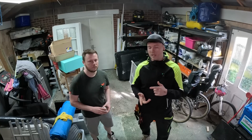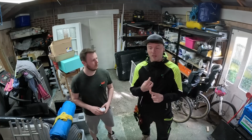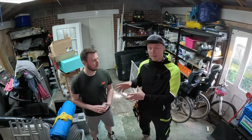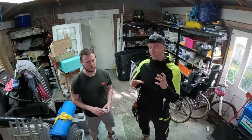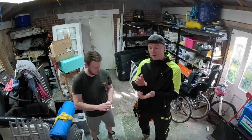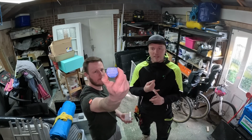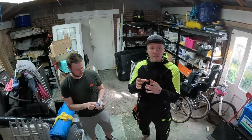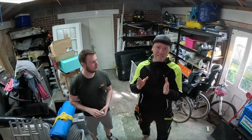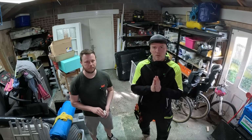You've already been up over the weekend, found out that we've got a JB next to it, which has got our load, our switch live, our permanent feed. So I'm here to put this in an adaptable box with some stuffing glands because the way it is designed, it's little and round. It can be fitted in the back of a switch, it can be fitted in light fittings, but we're going to put it in an adaptable box so it's a single installation contained within an enclosure. We can fix it, we can set it up, and it's easily accessible in the loft as well if we need to get to it. Okay, so I'll do the video on my channel of the installation.